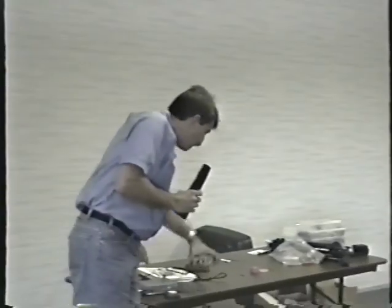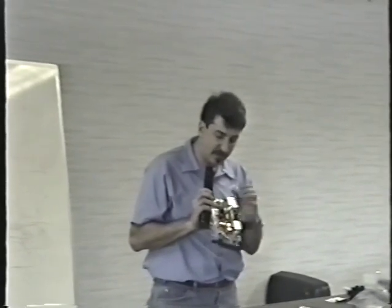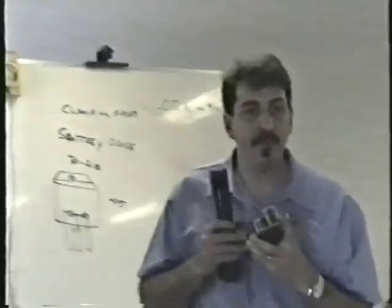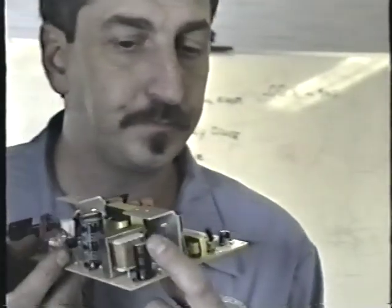Okay. Now, regardless of whether the fuse is blown or not, you always look at the filter capacitors. Remember, the filter capacitors are the ones in one corner of the board here. And also, I've seen this capacitor fail a lot. One of them in this room is bad because you showed it to me. This capacitor here filters what makes a 16-volt power supply that powers the chip over here on this side. I've seen this capacitor also go bad. This capacitor right here.